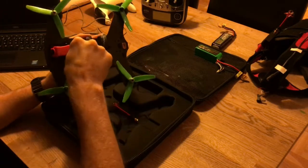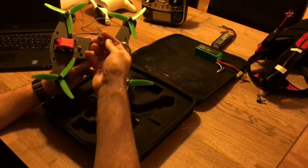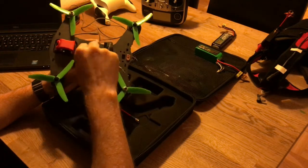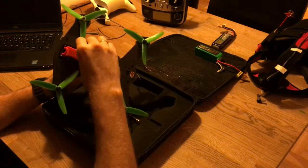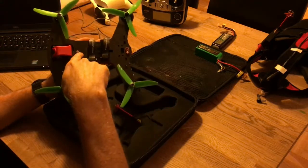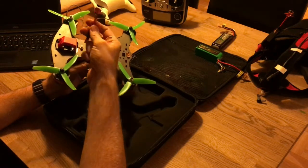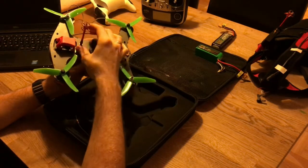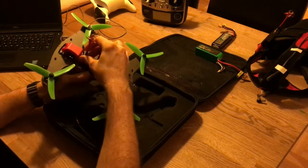I made this custom antenna and added an SMA connector to adapt the pin-out, since the board has a female adapter. I also put electrical tape around it so it fits very tight — this should be no problem when you crash. With the original antenna you just screw it down directly on the board and it's very rigid. My version is a little more flexible, but even so, a hard crash could still put strain on it, so be aware.